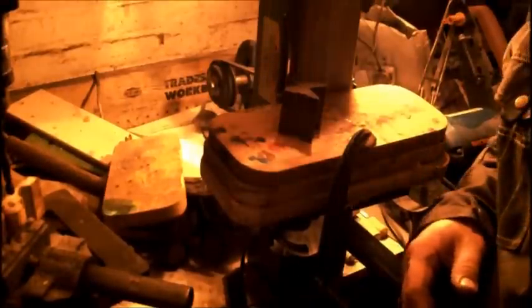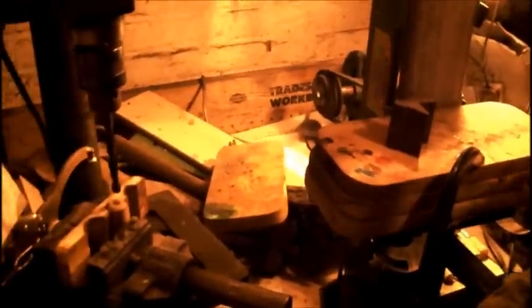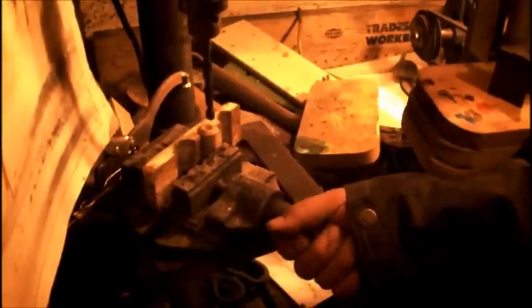After drilling the deeper hole, I've got this little bit of arrangement here. Should be able to see that. There. If I come to camera, I've got some Forstner bit drilled, bit of softwood, so it's sat in there at varying sizes, and then this part of the drill vise clamps it and holds it tight. So it's not as true vertical as what the V-clamp would be, but at least I got that pilot hole to start with. And not quite as deep as that original 4 mil hole.